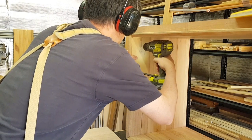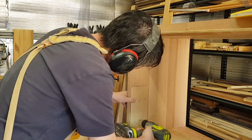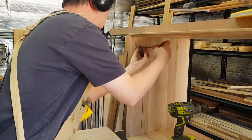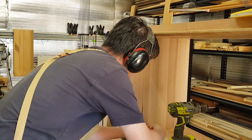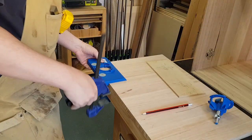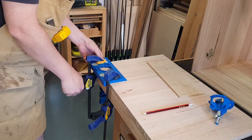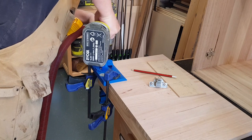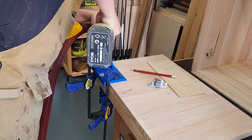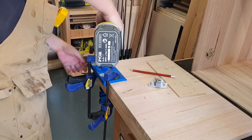Closely following the manufacturer instructions for the hinge, I made this template guide to help me position the holes for the bracket. These concealed hinges require a 35mm wide hole to be drilled into each panel door. I didn't own a 35mm Forstner bit, but I found this Craig concealed hinge jig at my local Bunnings, and considering a suitable Forstner bit on its own was nearly $35, this jig at around $50 Australian isn't bad and will at least help to drill these holes straight.